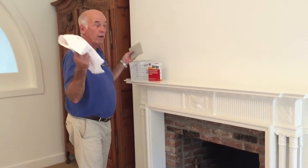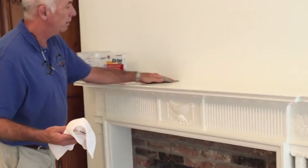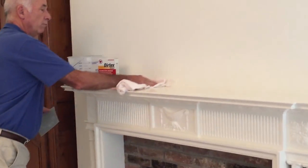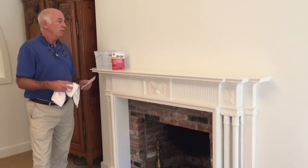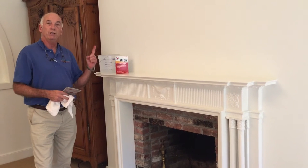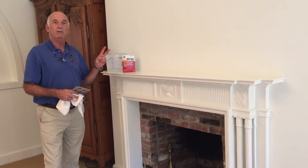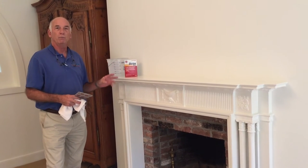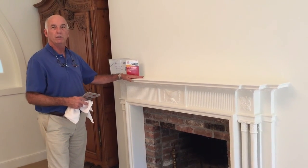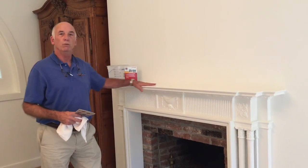Use a white cotton rag to give everything a rub, then wipe it off with the rag. If you prepare your wood surfaces in this manner, you'll generate no dust, you'll have a perfectly paint-ready surface. You'll have abraded the surface, you'll get great adhesion, and the job will look and feel like a buttery smooth finish.